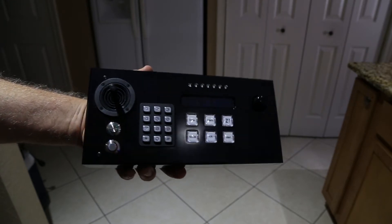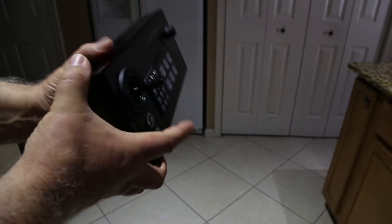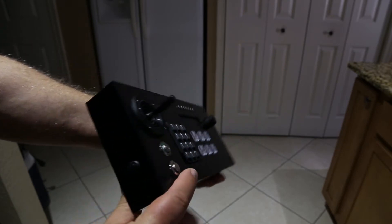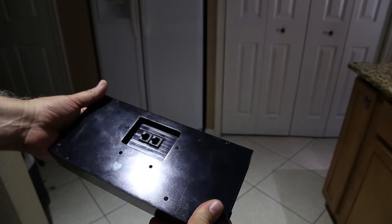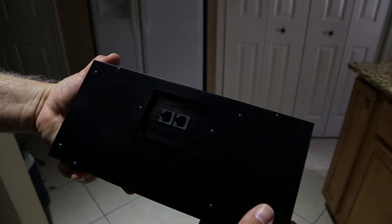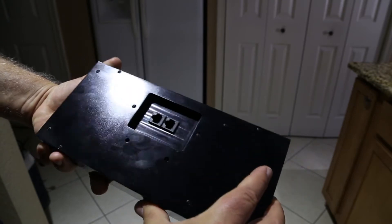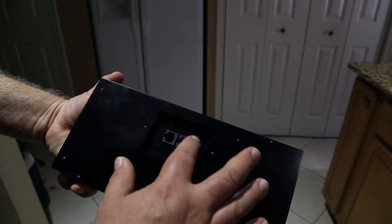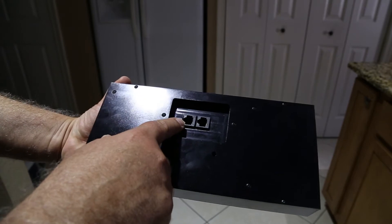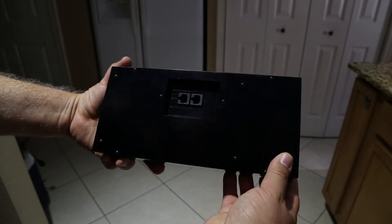If you're interested in having me build one of these for you, let me know. On the left side we have a push-on/push-off button, and the whole enclosure is machined out of aluminum — black anodized, bright-dipped — and I'm pretty happy with how that came out. On the back there are two RJ45 jacks: the first one handles power input and step/direction signals for the Z axis, and the second jack handles step/direction signals for the X and Y axes.